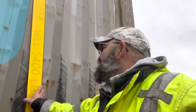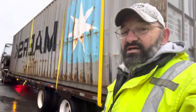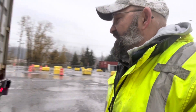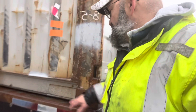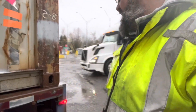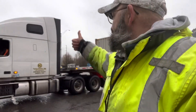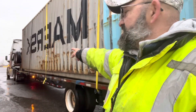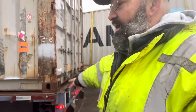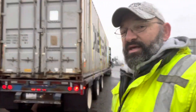Here we've got another strap, and then finally another one that's going to be a 5,400 to 5,500-pound strap. So the container is strapped with multiple straps. The only other thing we need to do is secure the brackets or bolts of the container from shifting backwards. Generally, we chain this down so the container can't slip. We chain it from this point, anchor it from here to about here, and that gets a complete seal on the container — especially if it can be latched onto the front deck. For now, we're going to secure it with a couple of ratchets and a chain on the back.